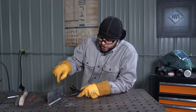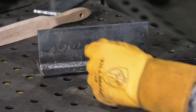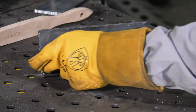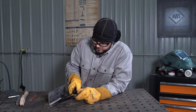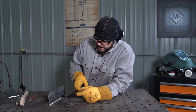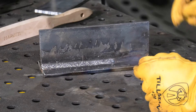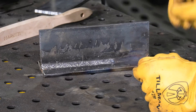What we're looking for in a good T-fillet weld with the E6010 electrode is a consistent profile, uniform weld size, and minimal undercutting to none at all. Here, we look at the toes of the welds — base material isn't undercut. The profile of the weld is convex. And the weld is centered in the joint root, making sure that it's penetrating into the root and tying in these two pieces of metal perfectly.